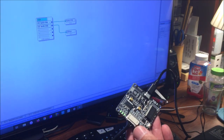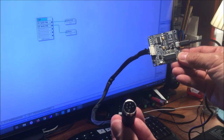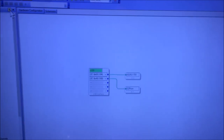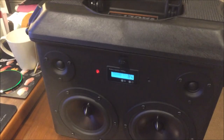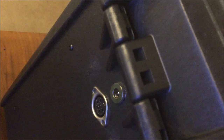Now the boombox needs to be on before I connect — if it's not on, it just won't communicate. The software may show green and talk with the ICP, but if you make changes to your tuning file, they won't be relayed to the boombox's ADAU-1701 chip in real time. So make sure your boombox is on, then plug in the custom cable. Now it's connected, and I'll use the OBS streaming software to show the screen captures. Let's go to the next frame.